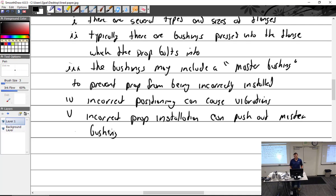So pay attention. You should never, ever on any component, on anything on aircraft, unless it was intended to do this, use the bolts, the bolting on an item, to press it into something. And I can't think of offhand anything that works that way. Every single thing in aviation goes together and then is tightened. You don't use the bolts to pull it in. If you're doing that, you gotta ask yourself, why are we doing this? I'm trying to think of some stuff in the shop that I know everybody says, I'm like, don't do that. There's a good example, the very next thing I'm going to talk about, a thrust nut. It was designed to do that.